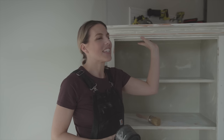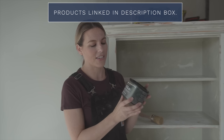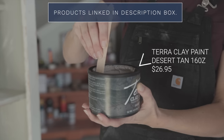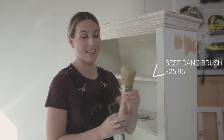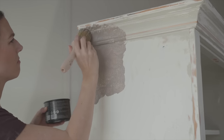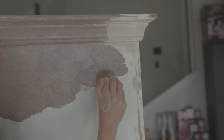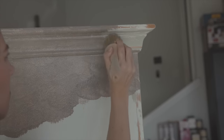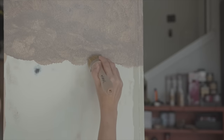I'm finally ready to paint. I don't know if this thing is worth it, but I got it for free so I always love to give it a shot. When I have a piece I don't care too much about, I love trying out new products. Today I'm using the Terra clay paint from Dixie Belle — it's a clay-based paint that's really textured. To get the look, they recommend using a natural bristle brush, dampening it, and painting in a stipple motion to get lots of nice texture.